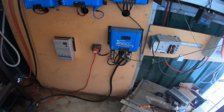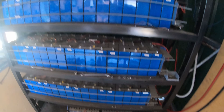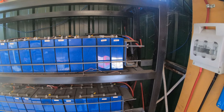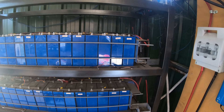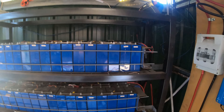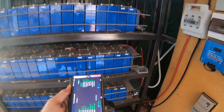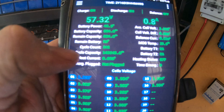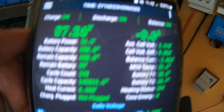The bottom pack always has the lowest voltage because of a tiny voltage drop, so all the current comes out of that one until it drops down enough that the other two share the load. That bottom one is on the other side of the shunt, so it's unmetered as far as our storage is concerned. There are 32 cells per shelf — it's a 2P16S configuration — giving 302 amp hours, so 604 amp hours total. We never see more than 350 amps pulled from the whole pack, which is around 0.6C for one shelf or about 0.2C across all three.